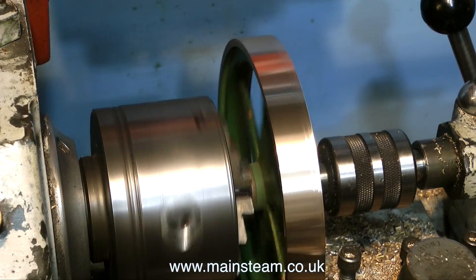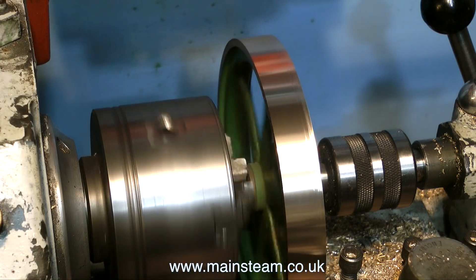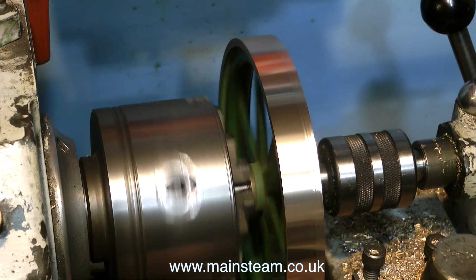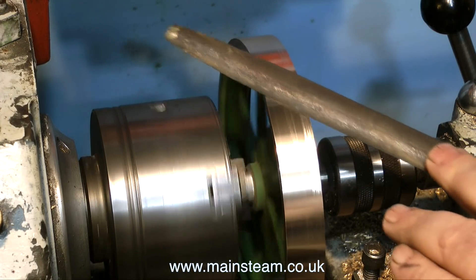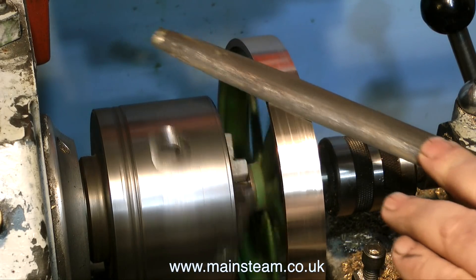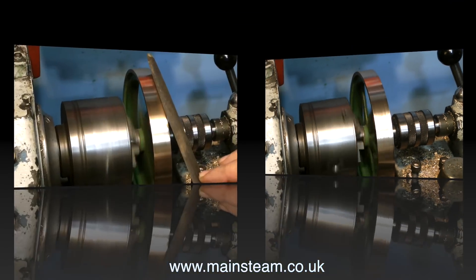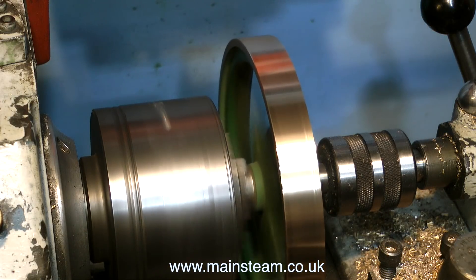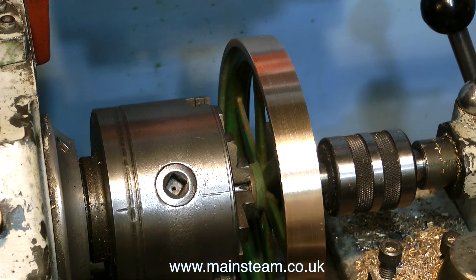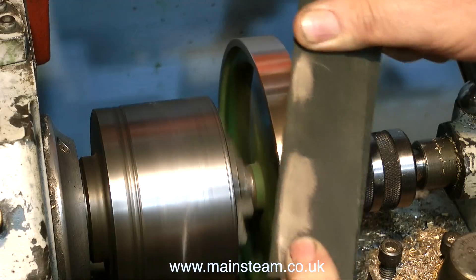As mentioned in the previous episode, the crankshaft arrangement on this engine is a little weird. I think at some stage the flywheels have been damaged, bent, and run out of true. Someone has run a die down the crankshaft and the thread is very peculiar — it starts off okay at 5/16 by 26 threads per inch, but later wobbles all over the place and the crankshaft is actually bent at the end. When the whole thing is fitted together with the pulleys acting as a locknut against the flywheel, the flywheels do not run very much out of true. What I'm trying to do is lightly machine the outer surface to get rid of all the mess, use sandpaper for the inner and outer rim, and when I finally assemble the engine I'll check how concentric the flywheels are and knock them back into shape if needed.